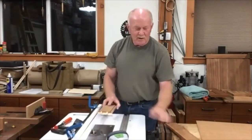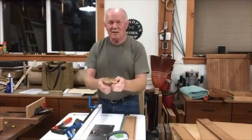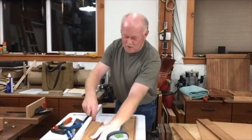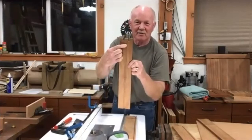The other piece, the stop is going to be on the opposite end because we're still putting the top against the fence. So in this case, the open end is going first. So I'm pushing it through and I have to have a mark on this side of the bit. So I stop pushing it and it's in the right place up here. Everybody good with that?